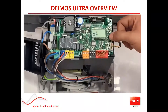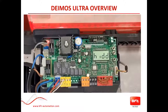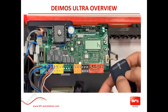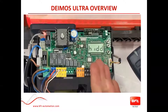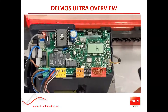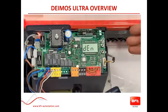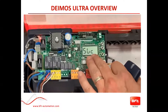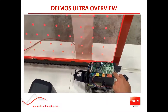Once you get an OK, push the OK button and it'll take you directly into remote programming. Whether you have the four-button or two-button remotes, push the two top buttons at exactly the same time until you see the light come on. The screen will say 'release' — let go and quickly tap the button you want to use, and you'll get an OK and a number: OK 1, OK 2, OK 13, and you can go up to about 63. It will stay in this mode all day until you are done programming all your remotes. Push OK when finished, it'll say 'end,' and SLC tells you the gate is closed.